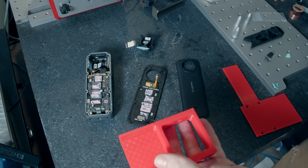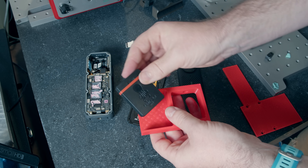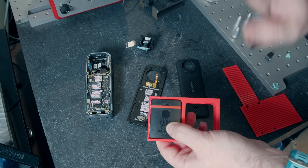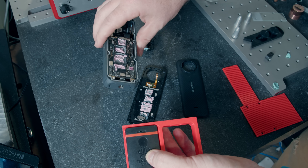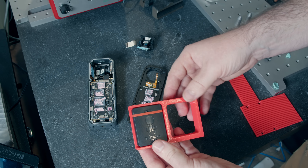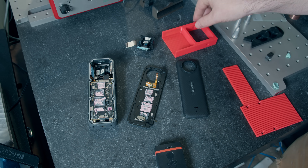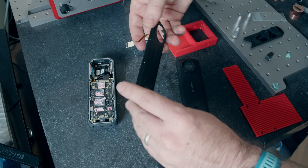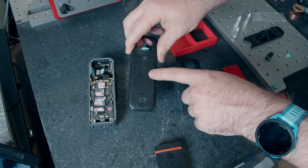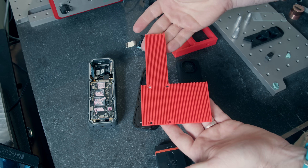The other purpose of the aluminum body is to house this little electronic — a Tentacle Sync, an audio syncing device I've been using recently. It'll just hang out down there, collect audio, and provide syncing timecode. That's the basic plan. Step one is milling the aluminum plate flat, deciding between CNC or the manual mill, and then from there we'll make the heat sink.